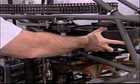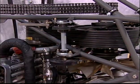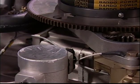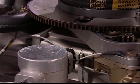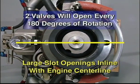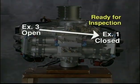Rotate the engine in a counterclockwise direction, looking down from the top, until two valves are fully open as shown earlier. These slot openings should be in line with the engine's center line. Two valves will open every 180 crankshaft degrees of rotation. The rocker arm opposite from the valve which is open is now ready for measurement and adjustment.